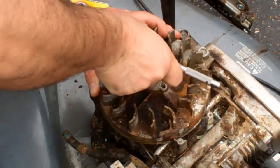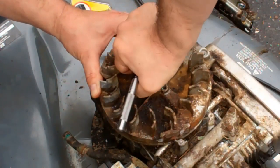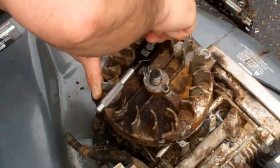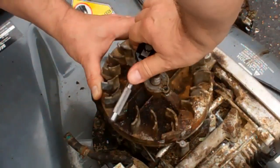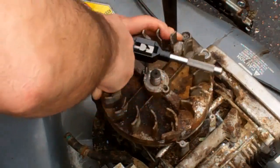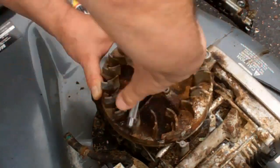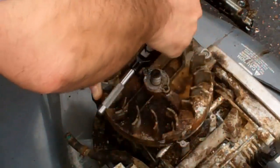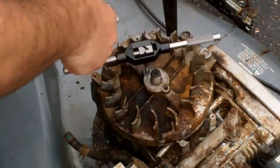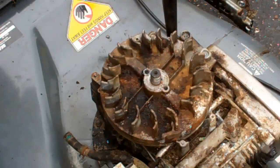Make sure you take a nice deep cut before you back it up for the first time. Back it up. You need to back this up and make sure you get all these filings out — back it up so you're going to cut better. A little more oil in there.